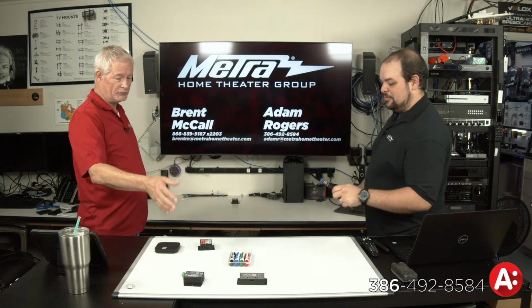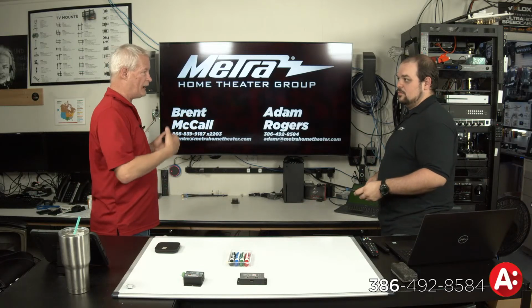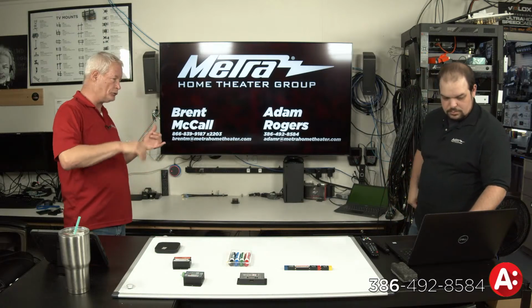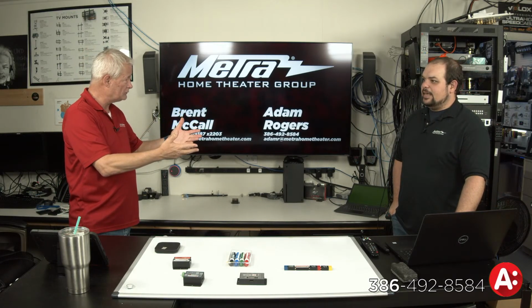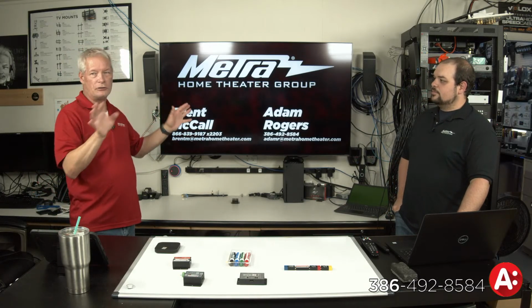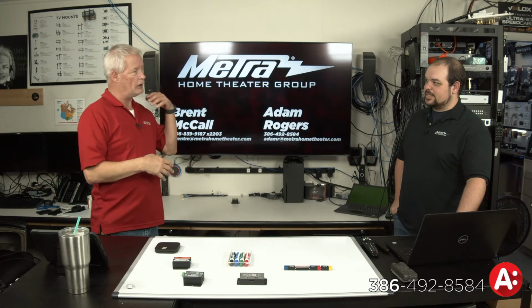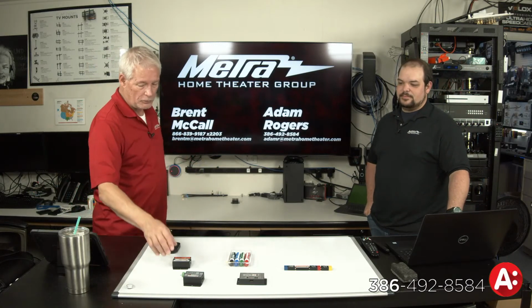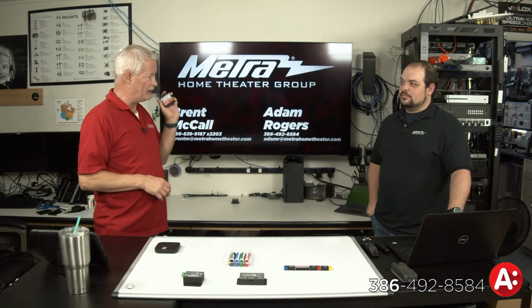Now, the nice thing about the DAD with the LEDs on it, it fully functions in the 4K environment as we know it today. So you can put it in a job, look at your 5-volt, look at your hot plug, which have to happen. We covered that 4 weeks ago, I think. Yes. So you've got to have those voltage transactions. No data, just straight voltage. And then the who are you, what are you, what's your resolution. Exactly. And the secret security handshake has to happen. Right. And you can track that with the DAD. So this is a wonderful tool to have in your kit.